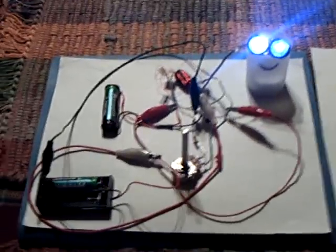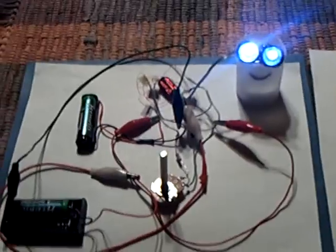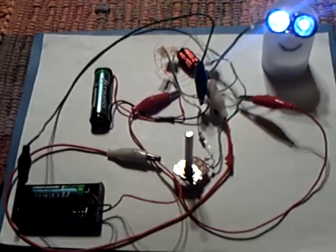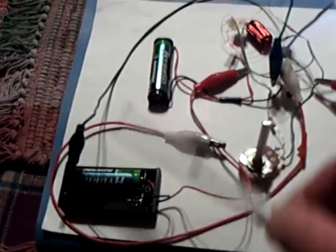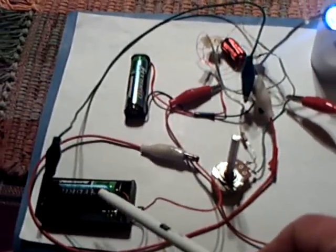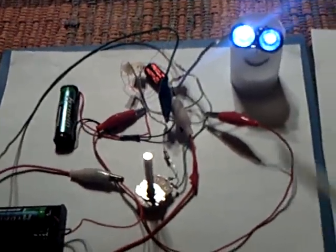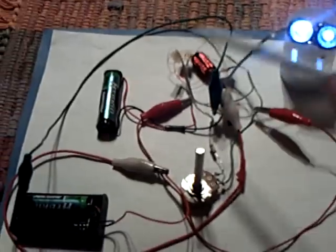Okay, here's a little update on the little Joule Thief project. It's going on 4 days, and I don't think it's going to stop probably for a number of more days. Every morning I get up and I change these two batteries back and forth, and one's at one point such and such, and one's a little less, and then I change them back, and they flip-flop back and forth on voltage. So what's happening is this thing is running at about 10 milliamps,